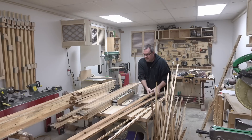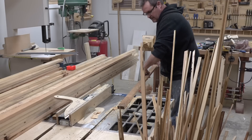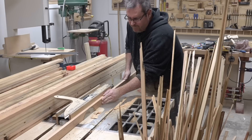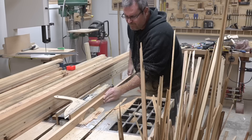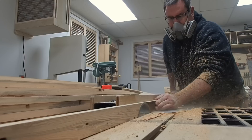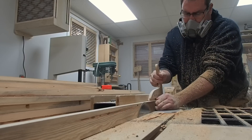I calculated what I need for the wall, and the total length of all the strips that I need is 368 feet. I figure I've easily got that here. Worst comes to worst, I can always cut more if I run out, but just a rough calculation, I've got around 400, so I should be good. I've decided to cut the face off to begin with. I may run this through the planer, but most likely I'll just sand it. I kind of like the circular pattern that the blade puts in — I think it's appropriate for the roughness of this wood. So I'm going to cut one face off on the saw, flip it over, cut the other side off, and that'll flatten them and clean them up.